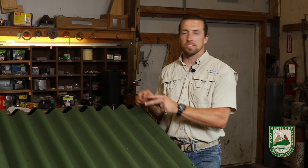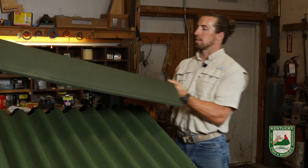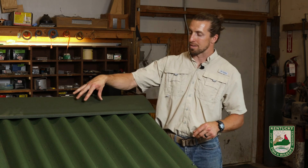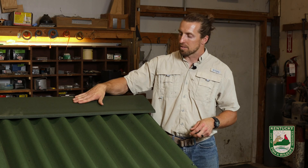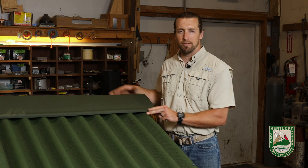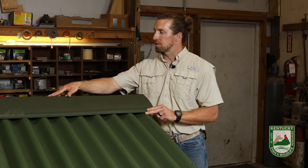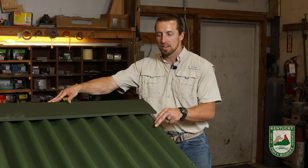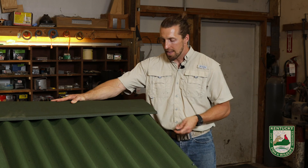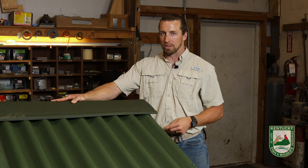Next and the final step as it relates to the roof assembly is the ridge cap. We're laying it right up on the roof, and you can see what it does – it produces a relatively puncture-free and seam-free assembly, because it covers up the majority of these screws and you need very few just to tack it down. Make sure it's centered either way, push it down with your hand so it contours to the slope of the roof. Pull it out just past your framing, then go through the same structure through one of the ridges and down into these mini purlins.